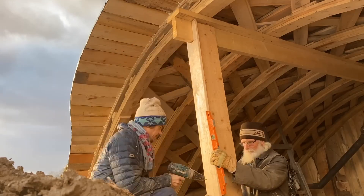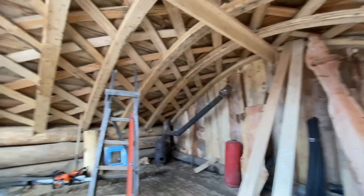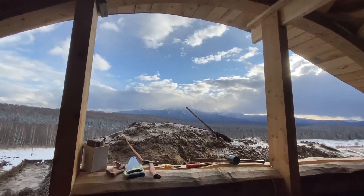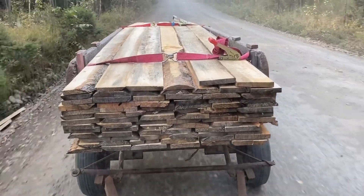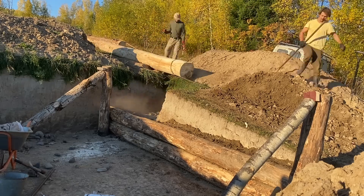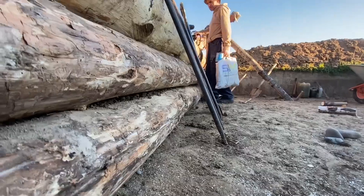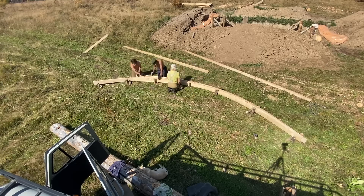Remarkably, starting from scratch in just six weeks at five hours per day, we constructed this 333 square foot — 30 square meter — home including triple-glazed windows, all for $2,000 including labor and all building materials. It was made from C-grade timber that we had to clean up ourselves. This low-cost and fast construction method blew my mind. Three friends can build each other a home in three months if only each one of them had just a foundation ready — and none of the three of us were macho rambos: Collier is 70, Vaisa is 61, and I've just turned 41.